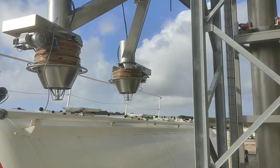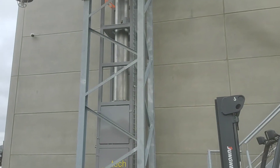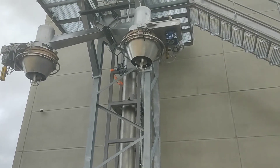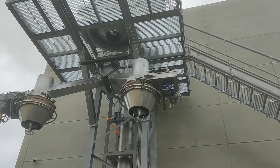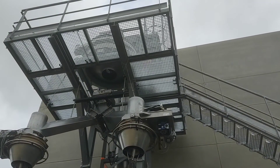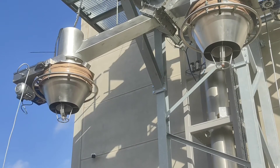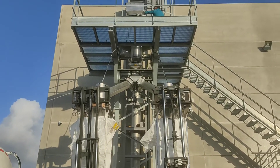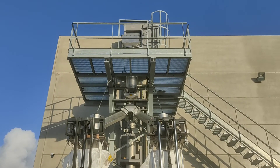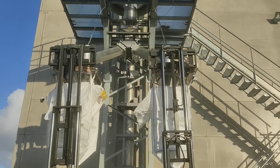So what we have is a very compact structure in which we can get rid of lumps and also any sort of impurities, thanks to the sieve and thanks to the magnetic separator when it comes to ferrous impurities. We can see that the discharge tubes can be enlarged and fit the height of the tank in every case when we have different types and sizes of tanks.